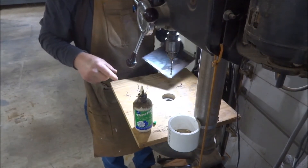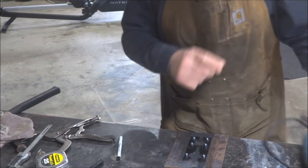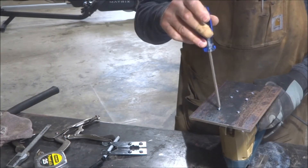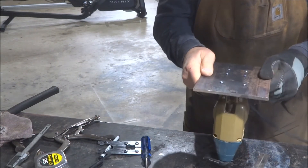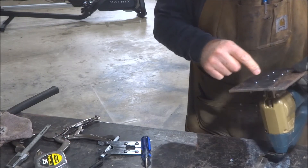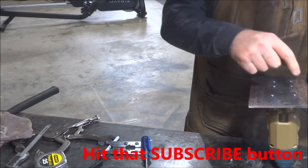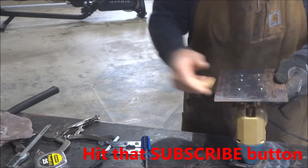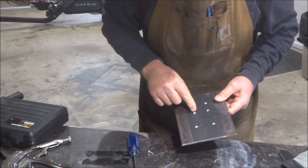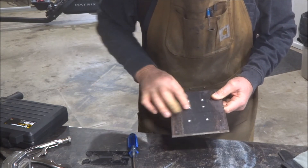Let's go put a little test fit on those. Let's make sure they fit in the steel plate. That fits in there just fine. Now we've got to countersink these holes a little bit, and then drill a hole for the blade to come through, plus some holes to secure it to that piece of plywood. We've got the countersinks done so the screws sit in there nice and flush — just a shade under the surface of the plate.